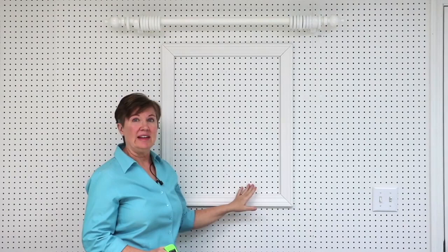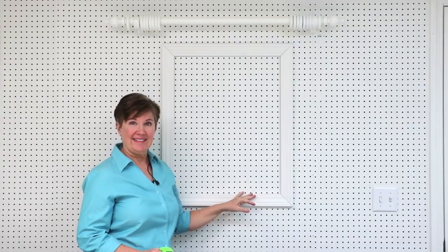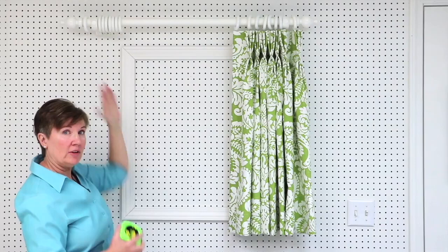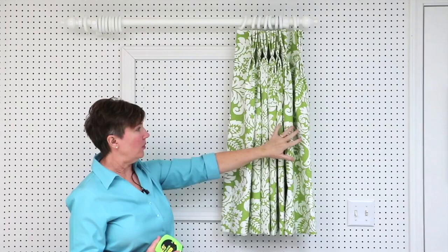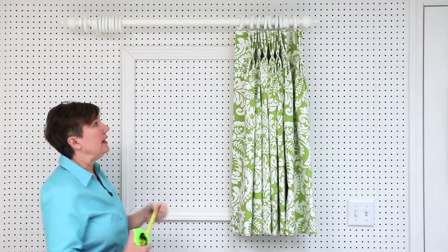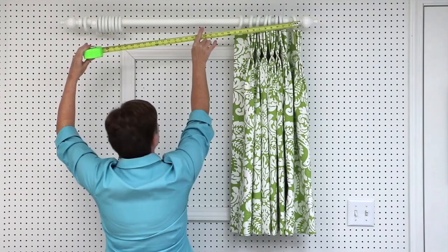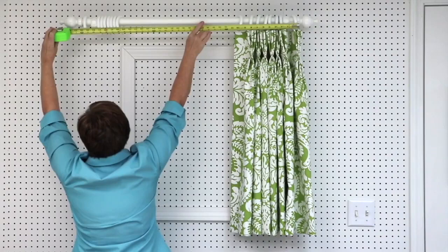After measuring your windows, you'll need to decide what type of drapery hardware you want. In our example I'm using a pole with rings. I've mounted the pole wider than the window — it makes the window look bigger and most of the panel will stack on the wall area instead of into the glass. The first measurement you'll need is from where the pole starts (not the outside of the finial) to the other end of the pole right before the finial.